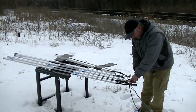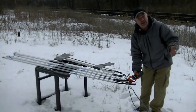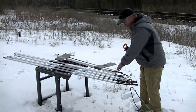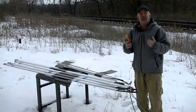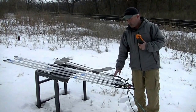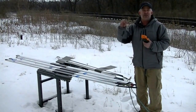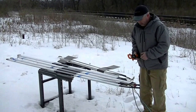By comparison, our 13-watt cable is drawing 1.72 amps — a great increase — so it truly is a step up in amp draw and wattage output. The other manufacturer's 12-watt cable just doesn't produce anything different than our 8-watt cable. Be aware of that. There are two or three other systems on the market that rely on this same cable calling itself a 12-watt cable, but in reality it doesn't produce anything different than our 8-watt cable.